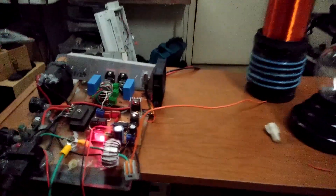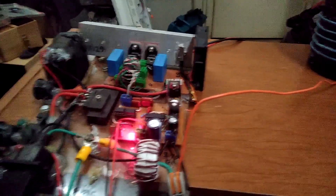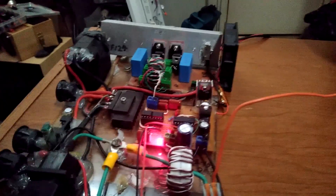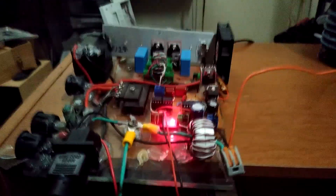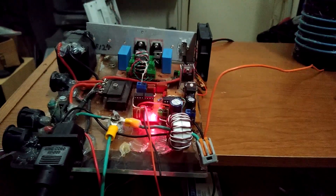This was my first mains Tesla coil circuit I was playing with, and I finally cleaned it up and changed out the fake gate drivers with real ones so I can use the enable pin. Using this Steve Ward interrupter you can get some pretty nice output with it. It runs continuous real nice, pulls some pretty fat arcs. Right now I'm just going to run it from the interrupter to where I've basically removed the limiter on the max on time.